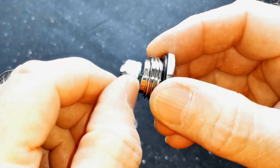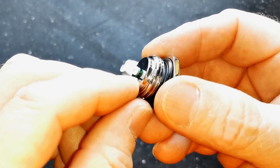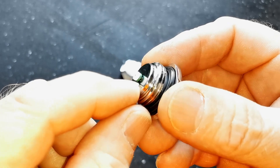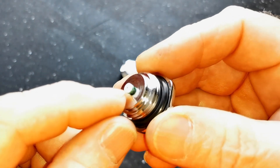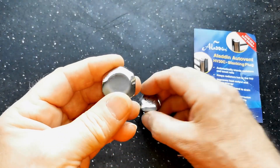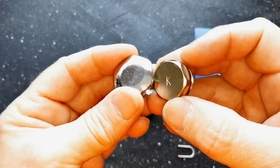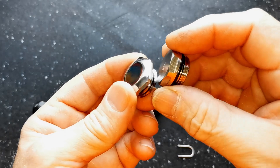The air goes out through a little hole behind that little plunger. That hole is very small — there's not a very big gap inside there behind that little rubber seal, and I don't think it would take a lot to block that up. That hole becoming blocked is not covered under your guarantee, so just bear that in mind. The finish on the blanking plug and the auto vent is very good — very nice bright shiny chrome, noticeably shinier than a standard air vent.